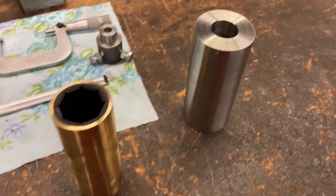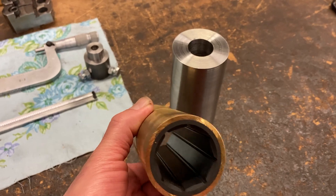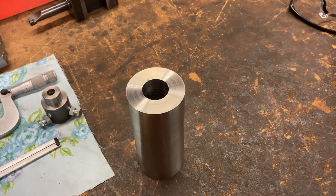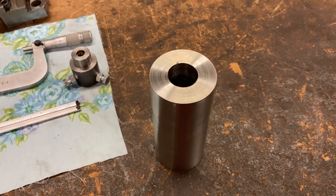This bearing is two inch OD, plus or minus. One end is a little bigger than the other, so we'll put the small end in first when we push it in, just to make it go a little easier. We're going to drill a hole through this, then we've got to bore it for a half thou press fit on that cutlass bearing.